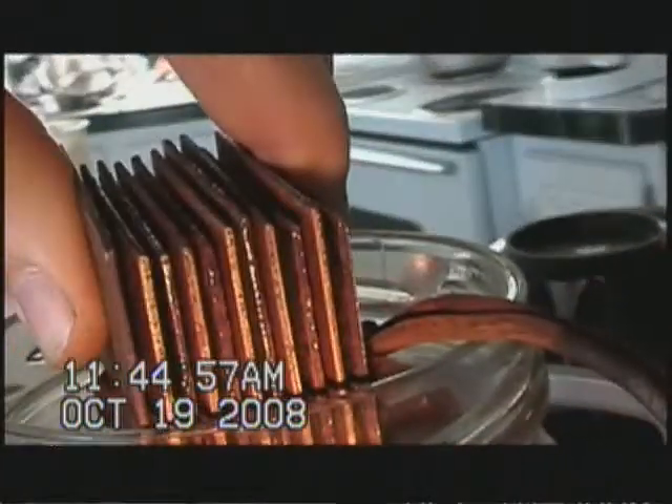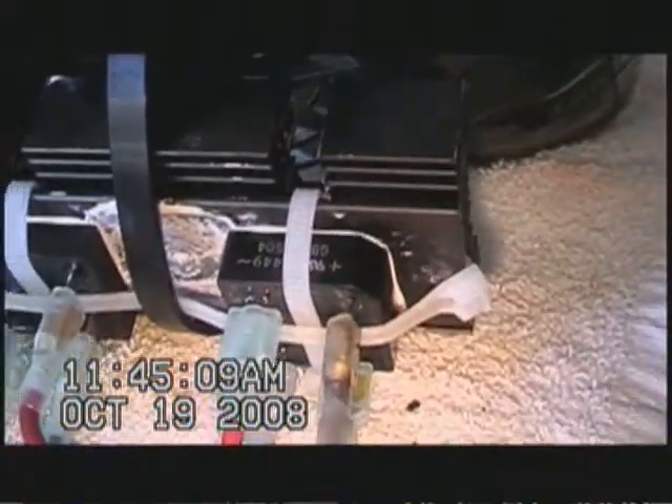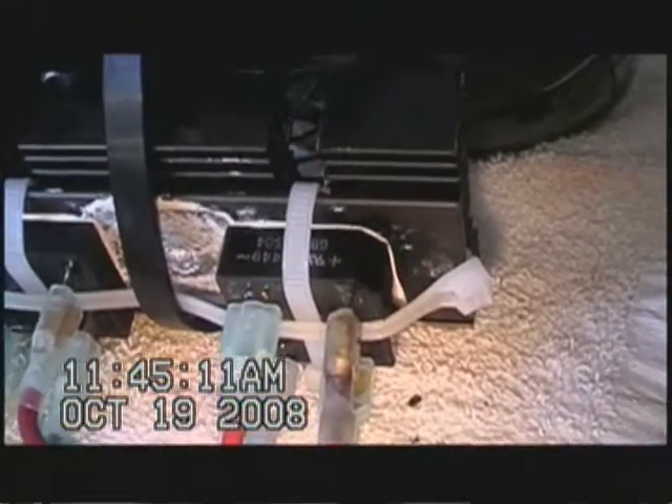What I have here is an 11-plate electrolyzer set up as positive-negative 11 plates, connected to a bridge rectifier, 50 amp. And in return, that is connected to my Variac.